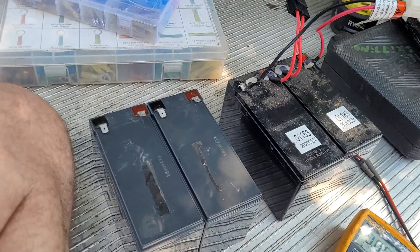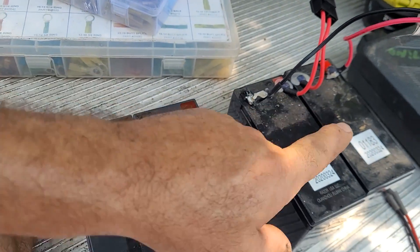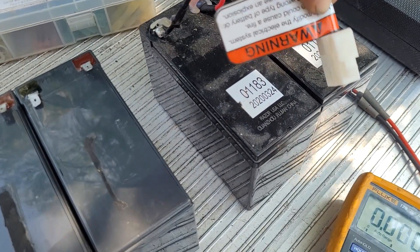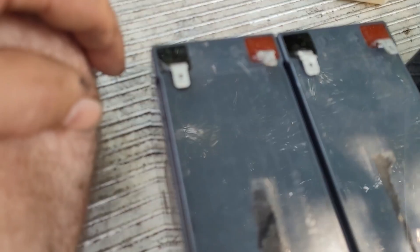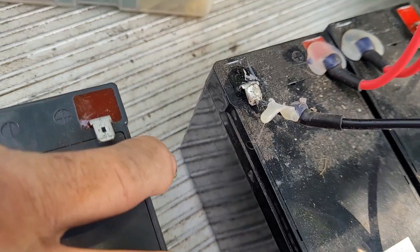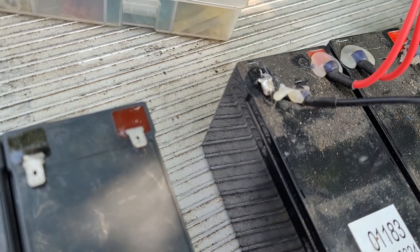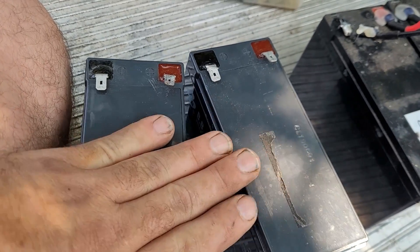Here's where we're at: I've got two batteries that test good - used, slightly almost new. The original dead pack was soldered, and probably comes as an assembly with the plug already put on. I'm just going to put standard flag terminals on and then put a little sealant just in case they come loose. I'm not sure why they would have soldered those - seems a little overkill for a children's toy - but we're just going to cut their soldered ends off and put female flag terminals on there. I just happen to have exactly the batteries they need.